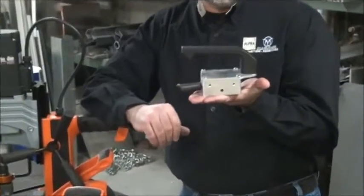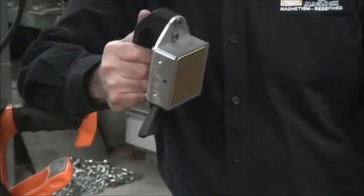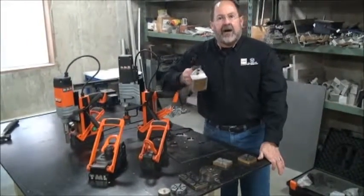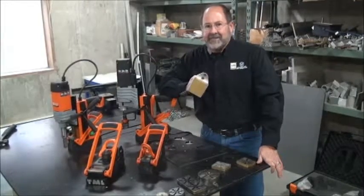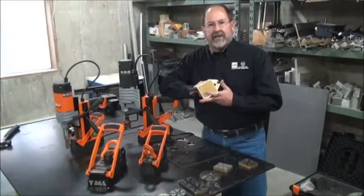It's designed in this particular case to be a hand lifter with an incredibly sturdy metal handle. What this does, it allows you to grab, whether it's vertically in shear, whether it's horizontally for a straight lift, all the weight that OSHA will let you safely carry. This has about 800 pounds of breakaway, so I'm not worried about picking up a 66 or 70 pound piece of steel and carrying it around all day long. This magnet will hold it for you.